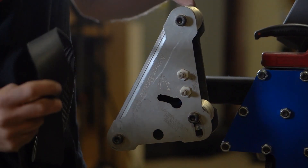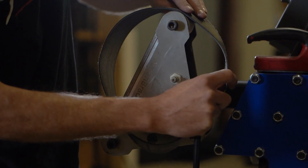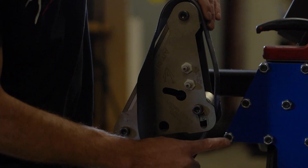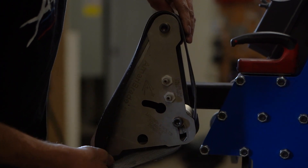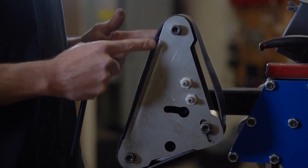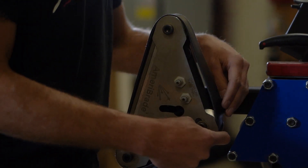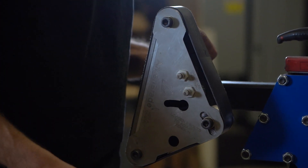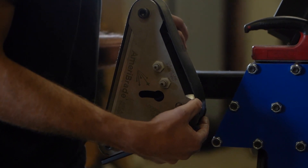When reinstalling the belt, do the same — make sure you are pushed all the way back. Get started on the top and the back wheel first and then slide over the bottom wheel. Be careful to match grooves on all three wheels before you pull tight. If you can see any of the grooves then you are not aligned and you need to shift over.